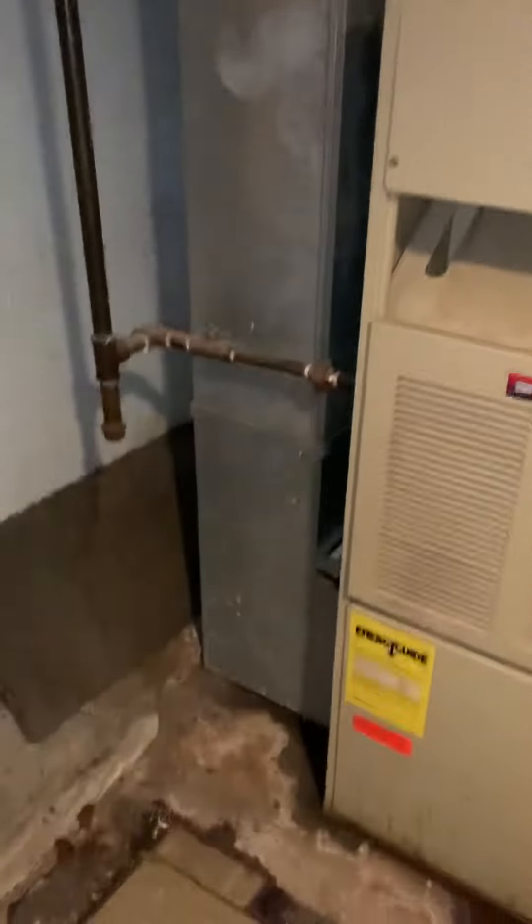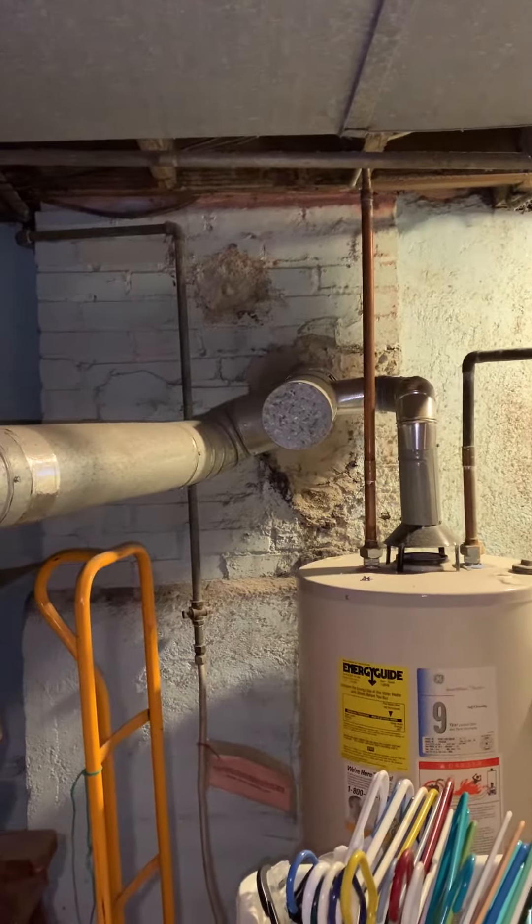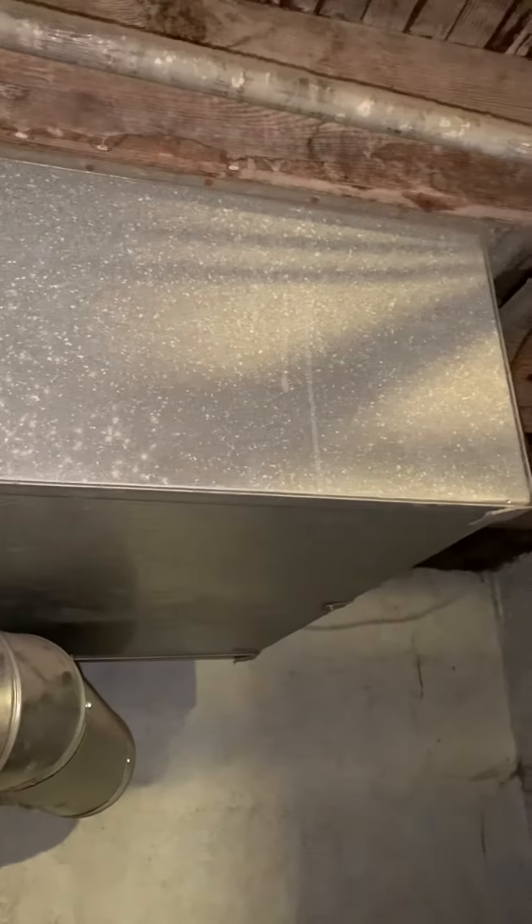It's going in place there. Five-inch flue liner keeps as is, but we'll need a five-to-four reducer and a new four-inch flue pipe to come over.